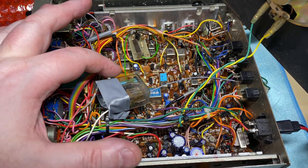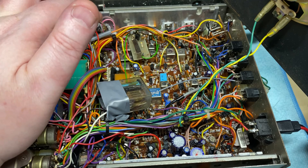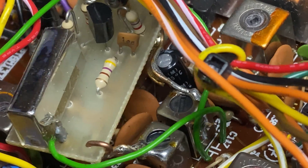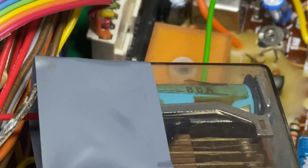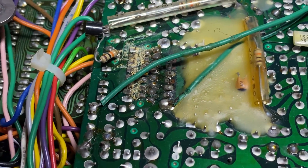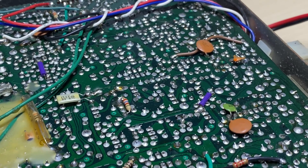We open it up and have a nice surprise. It has had modifications — apparently many years ago it had a hands-free kit with a button on the gear stick, and voltage was pushed up the microphone line for a Yaesu headset. There also seems to be an active ceramic filter in place of C117 and a really big relay just for switching TX. Looking at the back of the board there's been some work around the channel inversion unit — maybe that's been replaced at some point — but everything else looks fine with no other signs of mutilation.